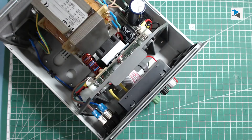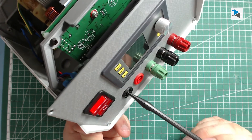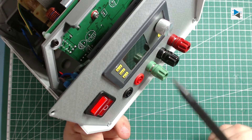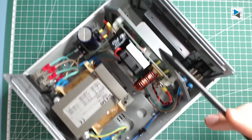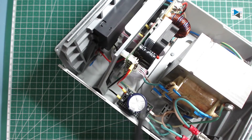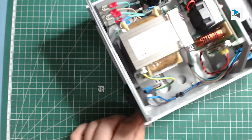Let's take a quick tour around the power supply. In the front we can see the control module in the center and the power switch on the left, followed by the insulated banana plugs, the earth terminal, and the power supply binding posts that have the standard spacing for any adapter we might want to use in the future. Right behind the front panel is the custom 3D printed bracket to which the PCB attaches, the input terminals, the smoothing capacitor connected to the full bridge rectifier, and the linear transformer. In the back we find the mains voltage input connector and the fuse holder.